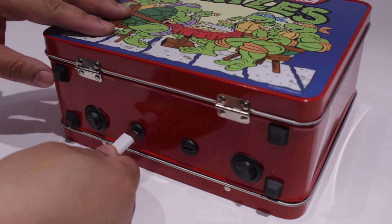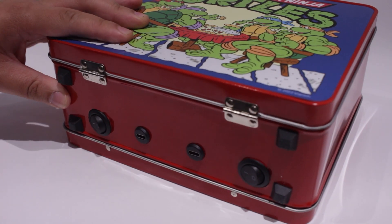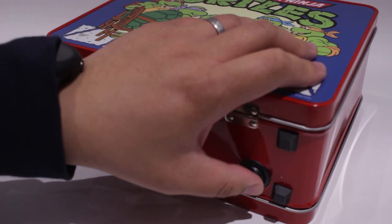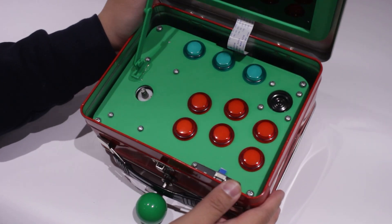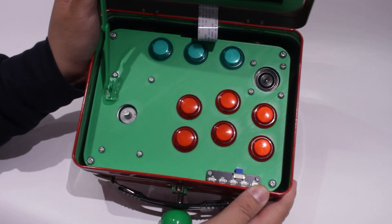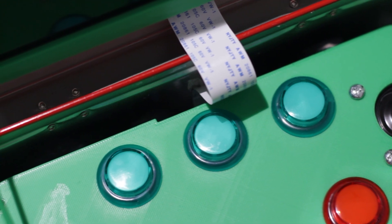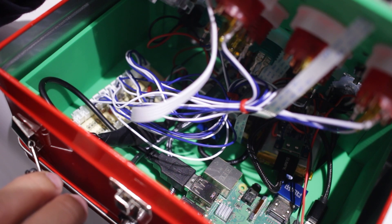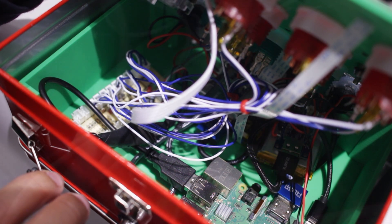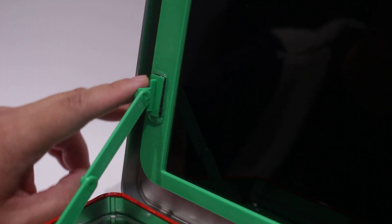On to the improvements. I think having two charging ports is a big issue, as it means I have to remember to charge two batteries before I can play, and obviously two power buttons to turn the screen and Raspberry Pi on. The size of the lunchbox was a little difficult to contend with, as I had to make sure I can fit the bottom and top piece without having to destroy the lunchbox in any way, but it does mean I have gaps around the edges. The inside is an absolute jungle of wires and parts not fitting in nice spots, but it's all hidden, so I guess I don't need to worry about that too much. I found the hinge a problem as the 3M tape was not strong enough to hold the screen upright.